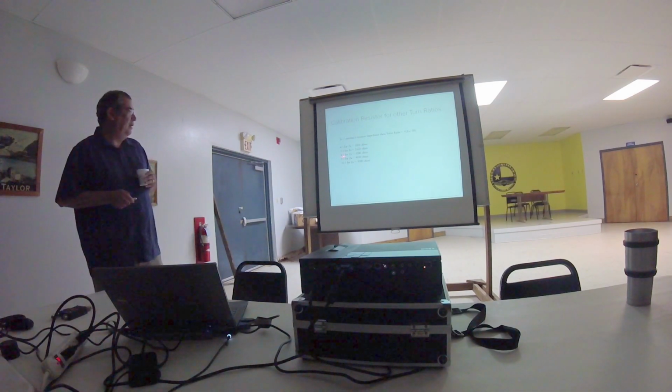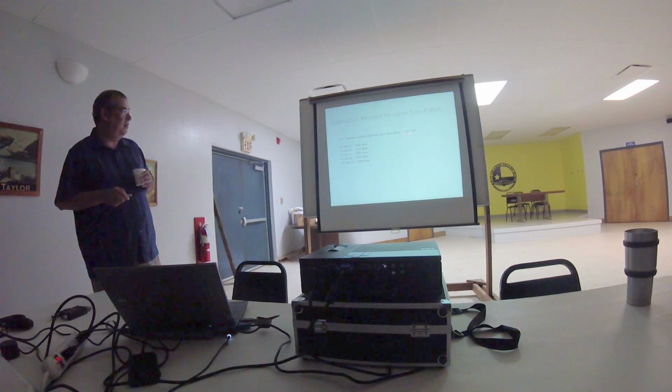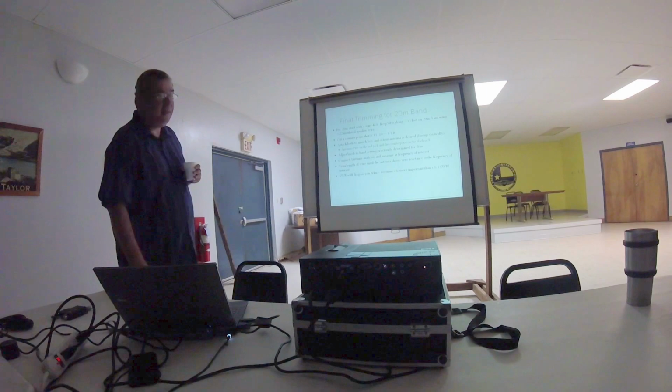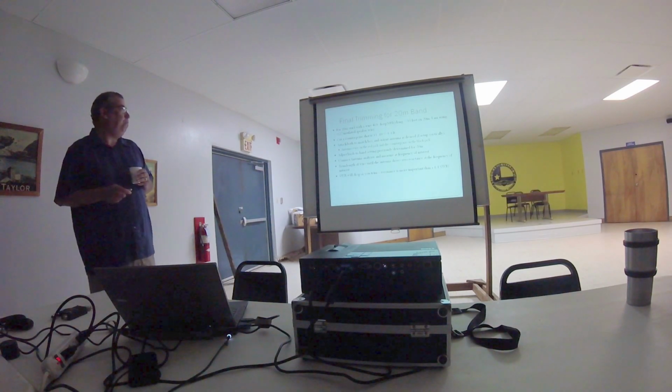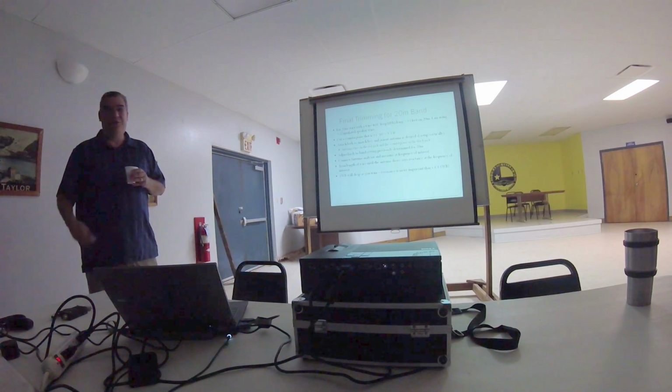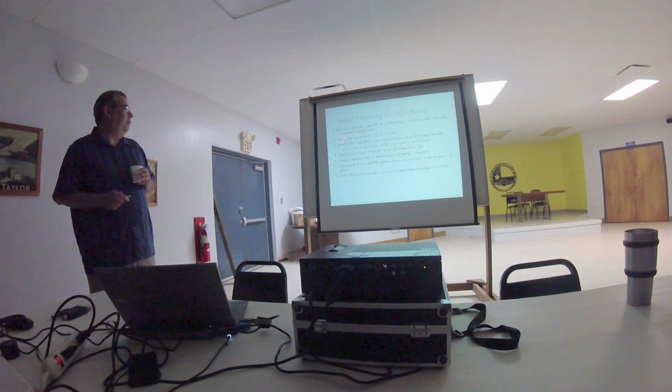For reference, if you use a different turns ratio, the resistance that you need to use for that calibration will change a bit based on this formula here. So then my final trimming: start with a dipole, the classic dipole antenna length formula. I came up with 33 feet on 20 meters. I'm using number 22 insulated speaker wire, so I'm not using anything really fancy. It's really fairly light wire. I cut the counterpoise to this length divided by 10, or about 3.3 feet.